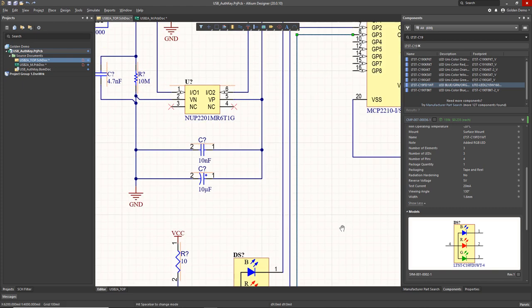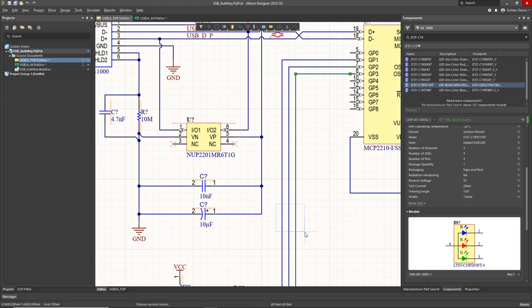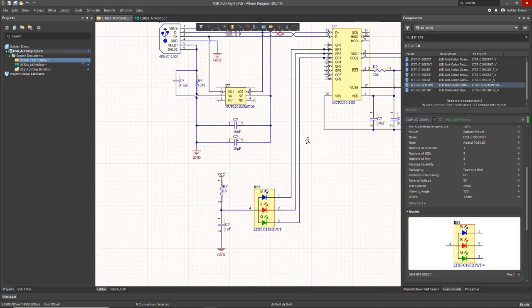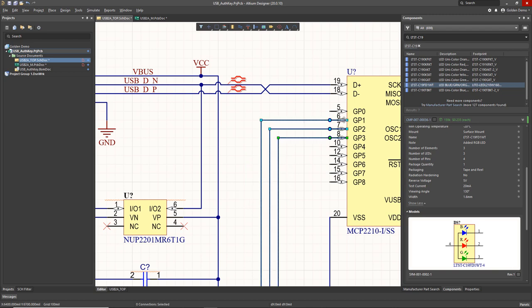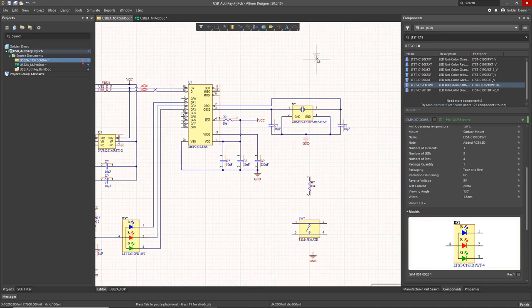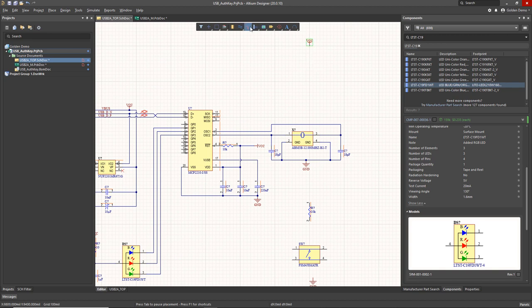Those are wired up, but I need to insert some dropping resistors into those, so I'm just going to move them over. If you select and grab the end of one of those wires and drag it, all of them drag together intelligently — just some of the wiring features of Altium Designer that save you a lot of time. Up here is where my encryption device is going to go later on, so I'll place the VCC and ground there ready for that. I'll place a capacitor there for the decoupling of that device and it inserts itself.